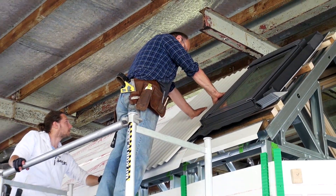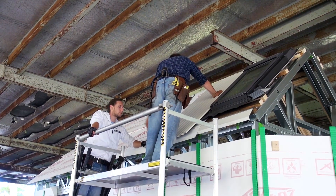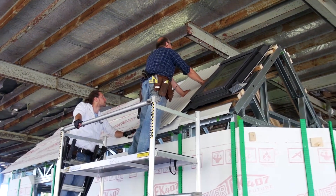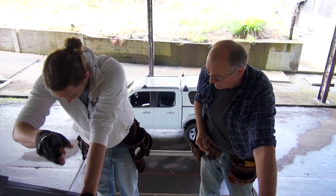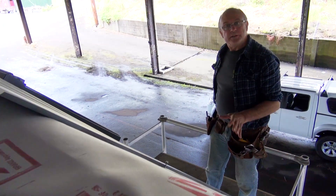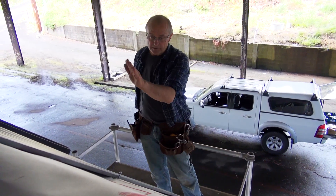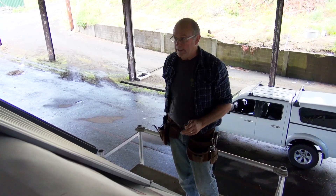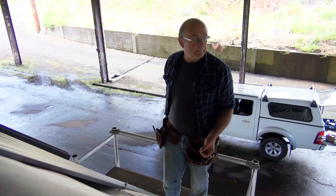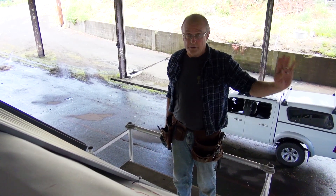We'll get this first sheet in the right place and put only a couple of screws in it, because we want to make sure we're heading parallel to the end. We need to make sure we fit the Velux and that we're not too high up. Get to the other end and measure from here to the end and from there to the end, and make sure we're running parallel along the roof. It's always good to take a bit of time to set this first sheet up because it'll dictate the rest of the entire roof. I'm going to put a couple of screws in to lock it in place, then put all the sheets on one after the other with only two, three, maybe four screws max in each sheet until we've got all the way to the end and know it's right.